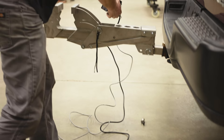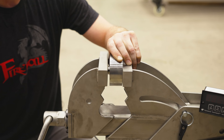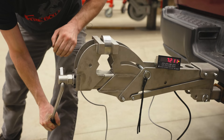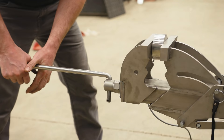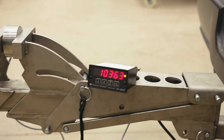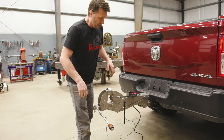Let's put a meter in between these jaws and see if it can make 10,000 pounds. Remember this is kind of the worst-case scenario — you might need a vise stranded on the side of the road somewhere. 2,000 — really easy to turn. 4,000, 5,000, 7,000. Am I going to make it? Almost. Yes! I did it — I met my goal. 10,000 pounds is a lot for a vise — that is really good news. Just with some of that quarter-inch plate. The jaws are strong enough, and my handle did not bend.